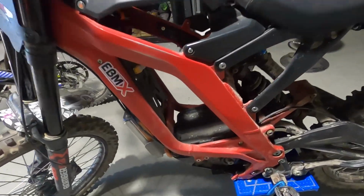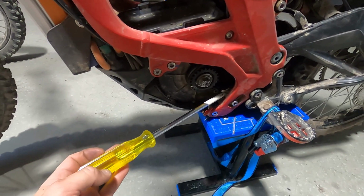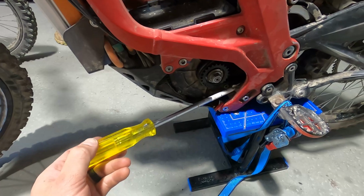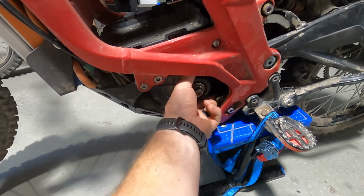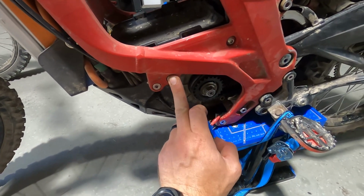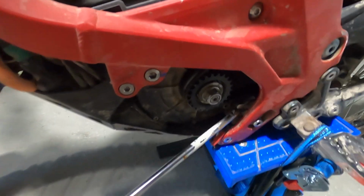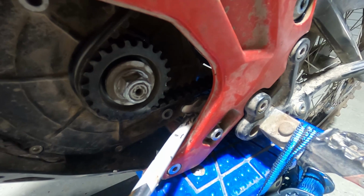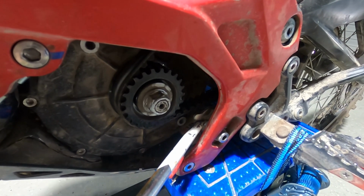So just a quick add to Truett's mention. This belt is meant to be an equivalent of the Gates belt that's around at the moment. Not sure whether it is, but the tension is obviously different per the product. One way to tension it: you need to loosen this bolt and this bolt here, and then on the other side as well. Then get a screwdriver in here, and you'll see this metal shaft that runs here. Put the screwdriver here, physically angle it up and push this up till you get the tension that you want. It has little notches so it will stay in place.